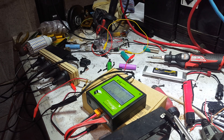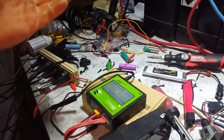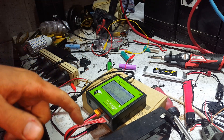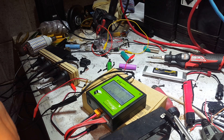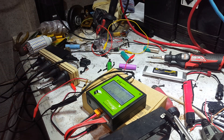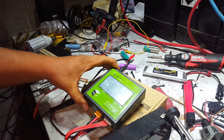Like I said, about 50 bucks on Banggood — link in the video description. I've used it a fair bit: I charged the two sealed lead acid 12 volt batteries in my work unit that run my inverter, and put 80 odd amp-hours into them. I set it to about 7 or 8 amps and let it run overnight. Woke up in the morning and it had pushed 70 amp-hours into those two little sealed batteries — it had certainly done its job. All the data was still on the screen, really cool backlit LCD.